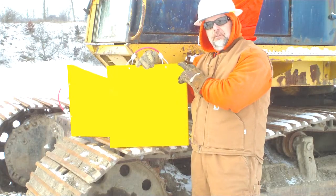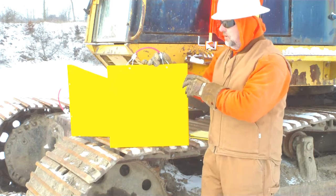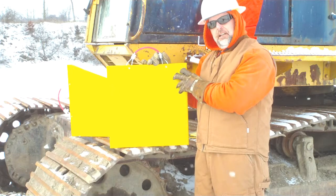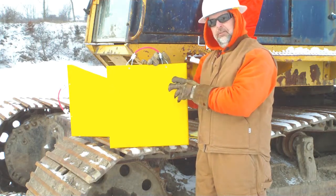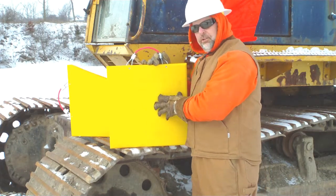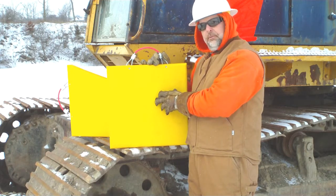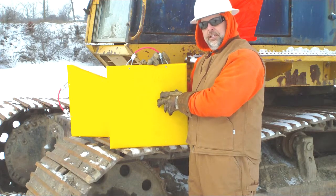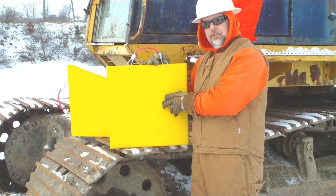The key features of all of our outrigger pads that we manufacture are several things. The first is the high visibility yellow — every pad we make is high visibility yellow so that any employee approaching the zone where pads lay down knows that it's a trip hazard. The second thing we do is put on a multi-textured anti-slip surface. This provides stable footing for any employee walking up to a bed door so that when they turn around to walk away they're not going to twist their ankle or their knee or create a personal injury.